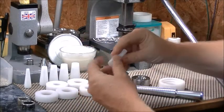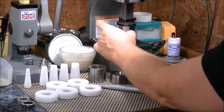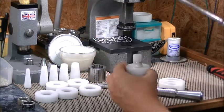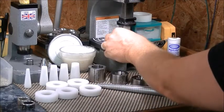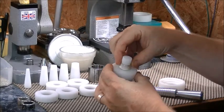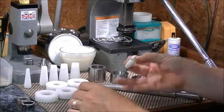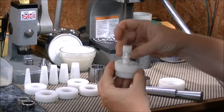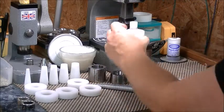Let's lubricate this cone, put it in our press, and give it a quick press down. I'm going to check it to see how close my cone is to my lid — I have just a little bit of space, so I'm going to go a little bit more. I'm right there at the lid now with very little space. I can still take it in and out. Now is the time where I can change my lid — go to the next size lid, place it on your stand, place the ring on your lid, and let's continue to press down a little bit more.